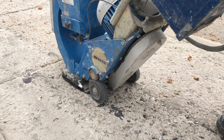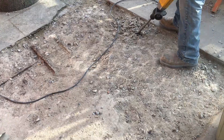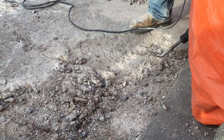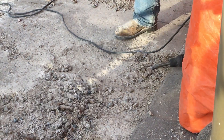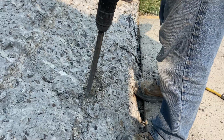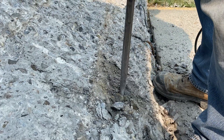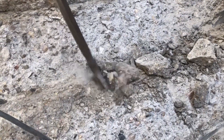This is going to do what pressure washers can do times about a hundred. You don't want to use pressure washers when there's really loose concrete that has to be chipped off. And then of course a step up from there, when the concrete is really bad — it's loose, it's more or less rotten, it's really structurally lost its integrity — that's where you start getting into jackhammering. These tools are going to remove really big, large pieces of concrete, as you're going to see in the following video examples. This is for really heavily damaged weak concrete so you can get yourself down to a nice solid base and make sure it's ready to receive a restoration.